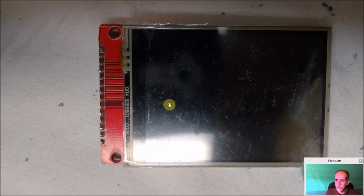But you have to be careful, because when you do cut this off, if you go too far, it's possible this will pull off the board and you have the potential of ripping these off. Again, can you fix it? Yeah, I have fixed things like that in the past, but it's tedious, and just take your time and do it. I say do it right the first time, but sometimes accidents do happen. So just be careful when you're cutting it down.